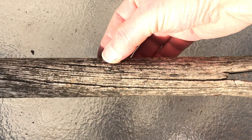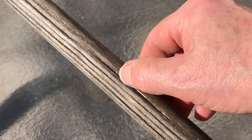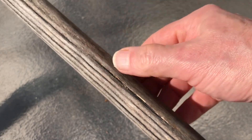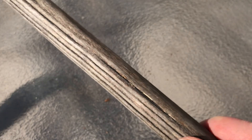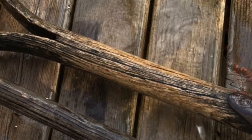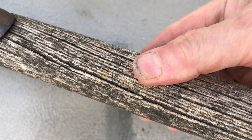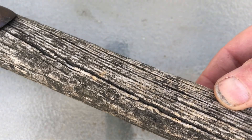The handles will start to break down and will get a rough texture that can scour your hand when you use them for a while. They'll also get ridges where the wood has opened up, and when you run your hand along them you can pick up some pretty nasty slivers if you're not careful. This is all due to water penetrating the wood and causing it to expand. If you let it go long enough, the cracks in the wood can also be receptive to fungus and dry rot, and the wood will break down even faster.